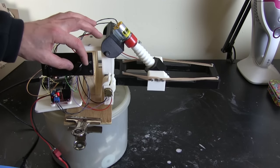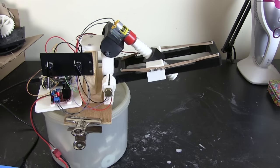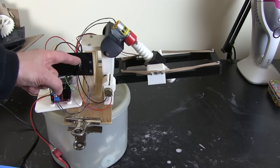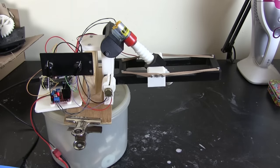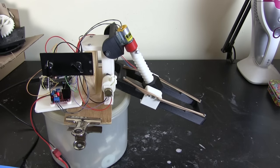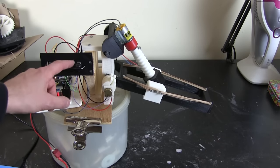What I'm using to control this is called a PID controller — proportional, integral, and derivative. It's the same one I used in my balancing ball robot when I built BB-8, and the second version of BB-8. The proportional part basically tries to drive the position to the set point: the input comes from the position sensor, the output drives the motor, and the proportional term means if the gap between set point and actual position is bigger, the motor goes faster, and as the gap closes the motor runs slower. So going from one extreme to the other, it starts very fast and decelerates as it arrives.